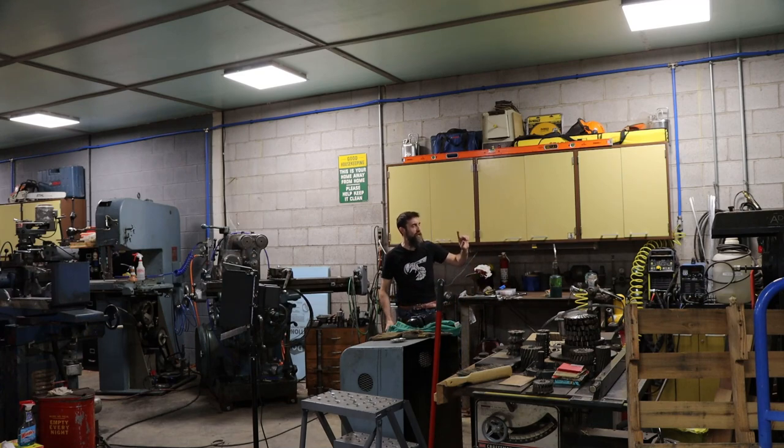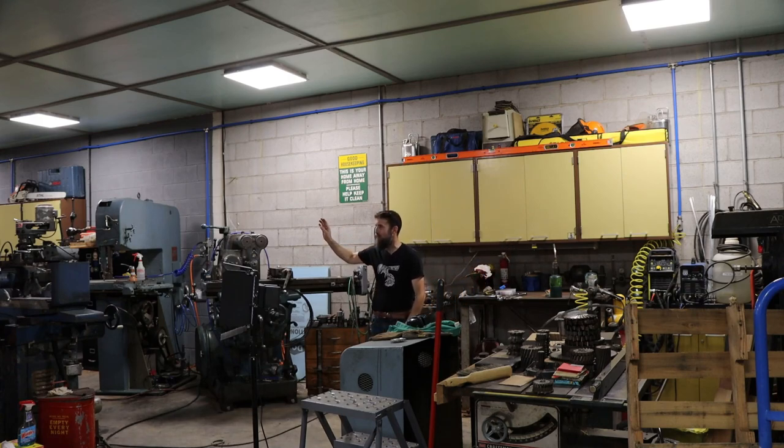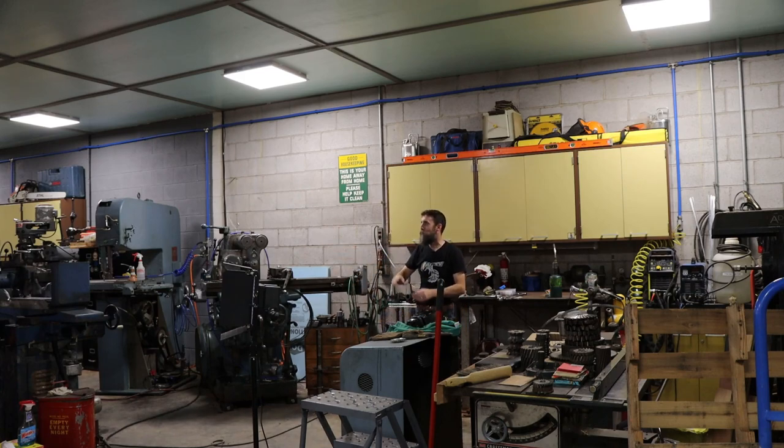I did end up putting an extra drop down here at the welding table. I thought that was appropriate. I found a manifold that I didn't know that I had, so I'm out of components right now, but I probably will put a drop down at the door to a hose reel. That way I can spool airline outside if I choose. So, welding bench, the vertical bandsaw, we have air at the lathe, I have air at the drill press, and I also have air down at the Do-All milling machine, and I have some updates on that for anybody who's interested.